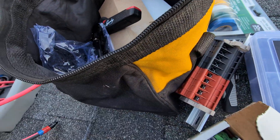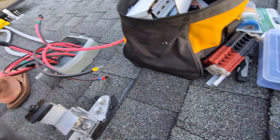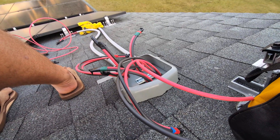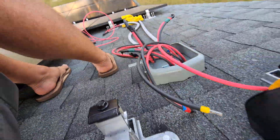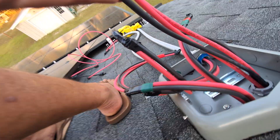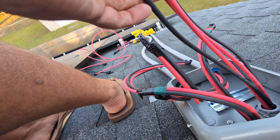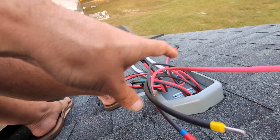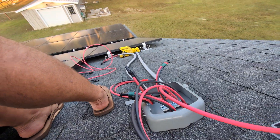I'll have to use a larger DIN, which I did order, because I suspected the wire would be just out of range — the wire from Signature Solar is really beefy and actually really nice wire. I highly recommend it for long-term projects where you don't want to do maintenance or burn your house down: buy good wire, buy UL-listed, American-made wire from Signature Solar. This is sun-resistant and direct-burial rated PV wire — a wet/dry location specific-use wire — and it's really important to get the right conductors for the application.